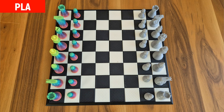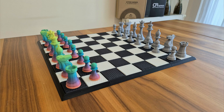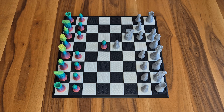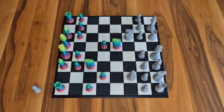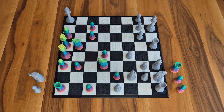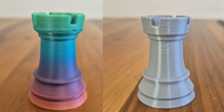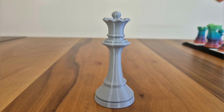After these test models, my next print was a chess set. I used PLA, PETG, ABS, and ASA materials together — the chess pieces with PLA, the black frame with PETG, the white squares with ABS, and the black squares with ASA filament. I had a color-changing filament from Creality CR and made one set colorful and another in gray. When I looked at both models, their surface qualities were quite successful. Despite the prints being done quickly, I don't see serious errors in the vast majority of such models.